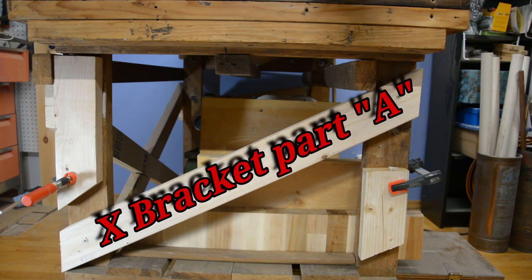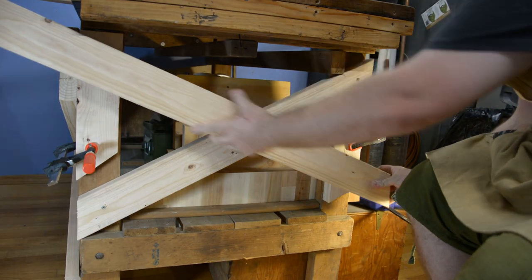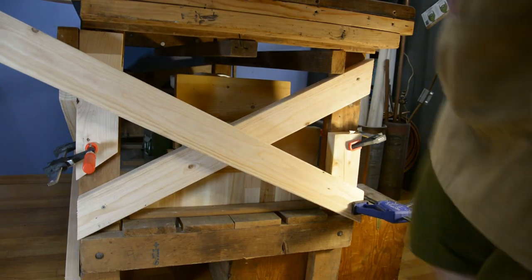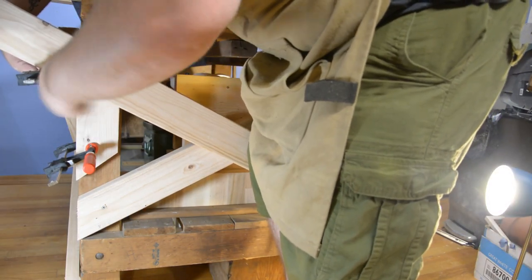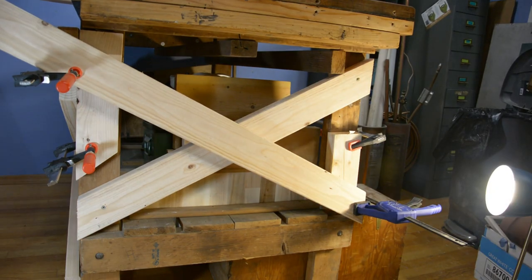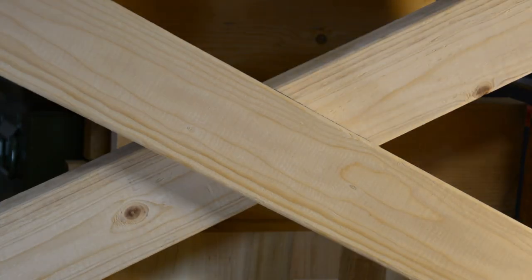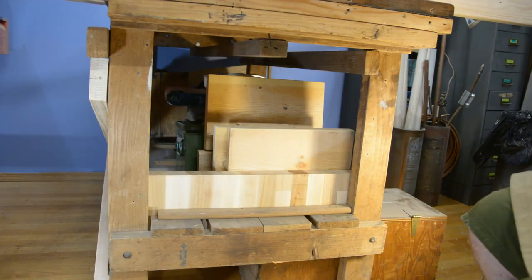What we'll have is the X-bracket Part A in the center, and then spacer 1 and spacer 2 on either side. What these spacers do for us is make it way easier when we go to make Part B of the bracket. All you have to do is clamp it up, and this allows us the proper spacing to make all of the marks we need to. Other than repeating the process for the length marks we made on the first piece, we also mark out where the boards cross on each beam, and then take everything off that we just did.